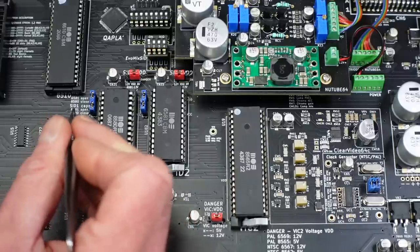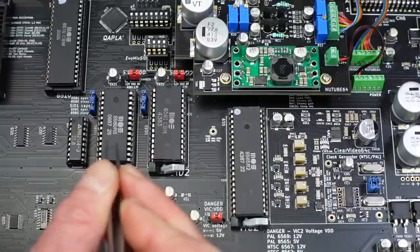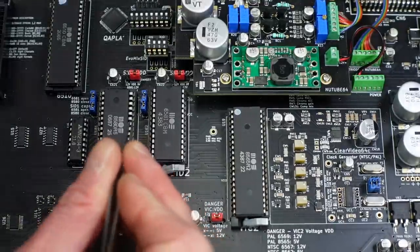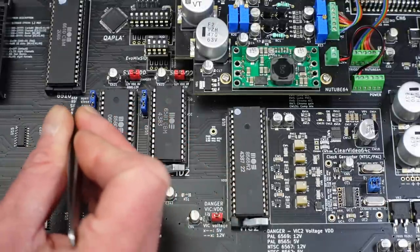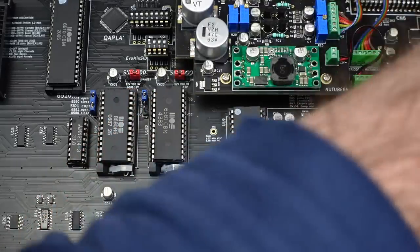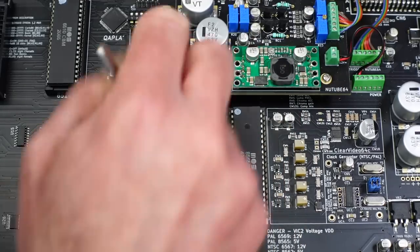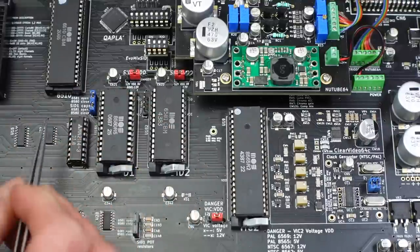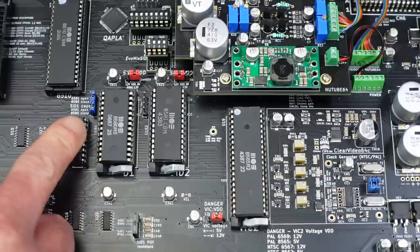So we need to jumper this to the capacitors. They actually use different capacitors on the audio output for both revisions. So we are going to have to put both of these jumpers into open for the 6581, actually, which is what we're going to do. And the 8580 needs both of these closed. It's also all written on the silkscreen, thankfully, so that makes things significantly easier.